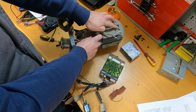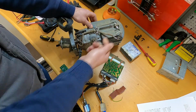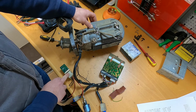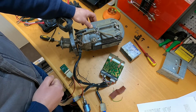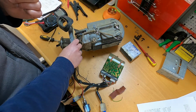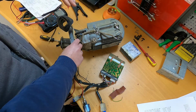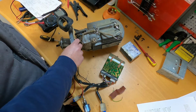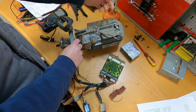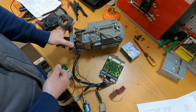And if it detects the flame by opening, I also simulated that, then yes, this will stop the glow plug, but also the pump will stop after a while. So I'm not really sure what detects the flame in this unit. In the manuals it's not stated that this switch should be open or closed. Yes, on the drawing it's shown in the closed position, but I'm not really sure how it works. So this is something I will have to dig up some more information on.